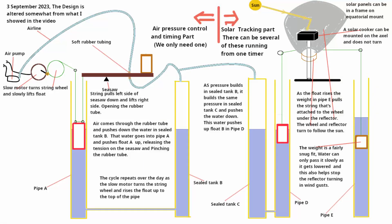15 degrees per hour is kind of hard to actually precisely do, so I have an imprecise method to do it, and then you get the precision by turning on and off the motor that controls the speed by the correct amount. So I turn it on and off — in this case on for two minutes and off for one and a half minutes — and this means my imprecise device will actually go at any speed I want, so I can get it to go at exactly the right speed.